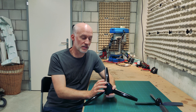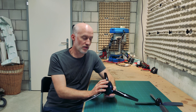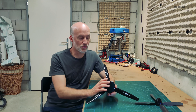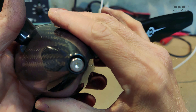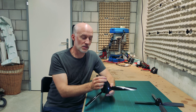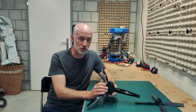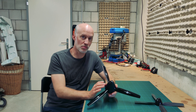On this sample with a center screw on the spinner, you also have two things to be aware of. The adapter often doesn't come with the spinner, so you have to check and have the right hardware screw to make the spinner fit on your prop adapter. The screw can also have some play in the center hole of your spinner, which can also lead to vibrations. I'll show you everything to avoid all these issues and have a perfectly centered spinner with the lowest possible vibrations.